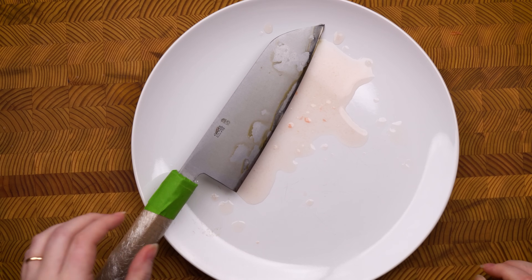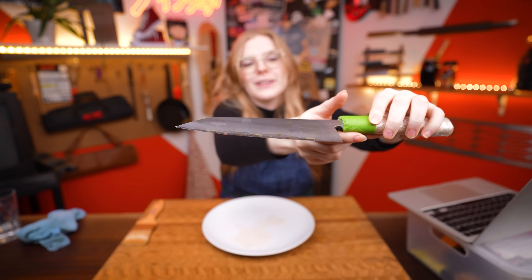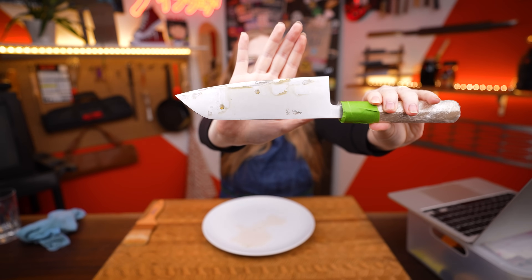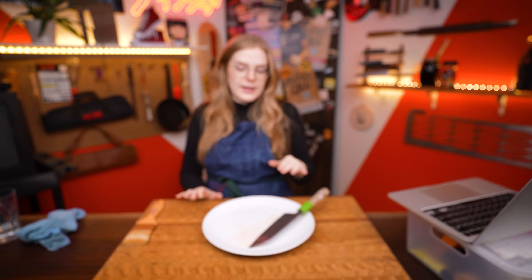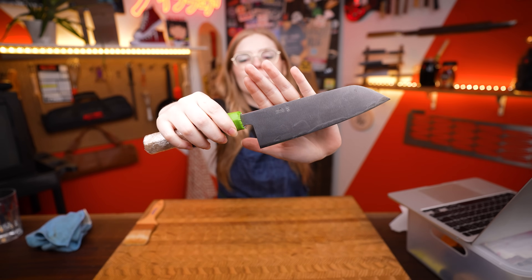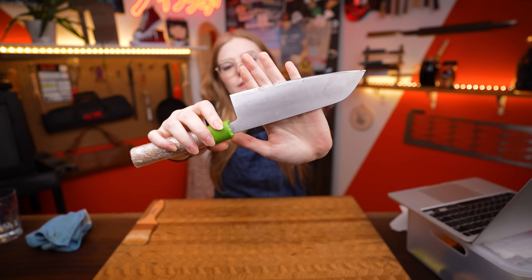It's been 15 minutes and this is how you rust a knife. We do have a little bit of patina, but we got a lot of orange and yellow on there and that is rust. That happened because we didn't wipe it off quite enough — there was a little bit too much on the knife. I'm going to wash it off with soap and water to get the surface-level rust off, and hopefully that leaves a little bit of patina. Surface-level rust that's just happened is really, really easy to clean off.